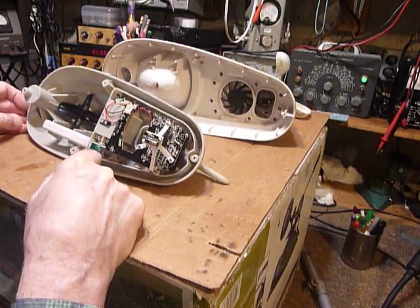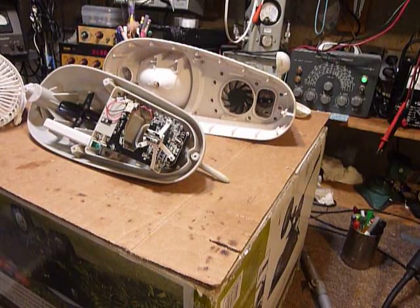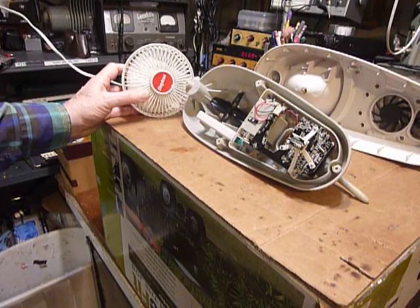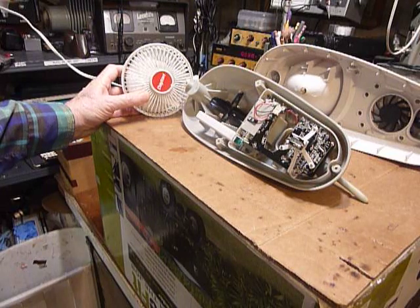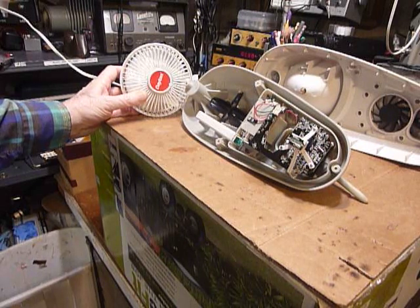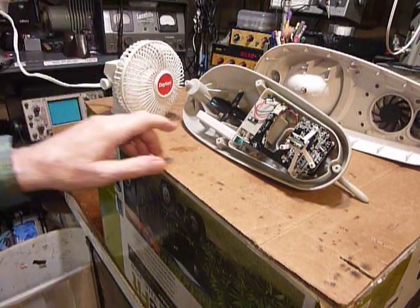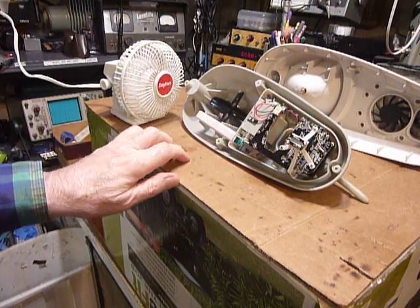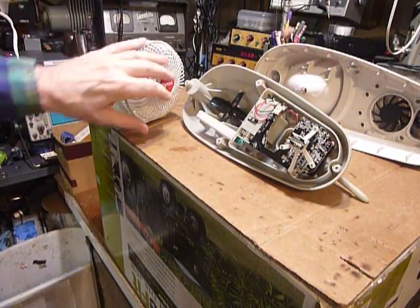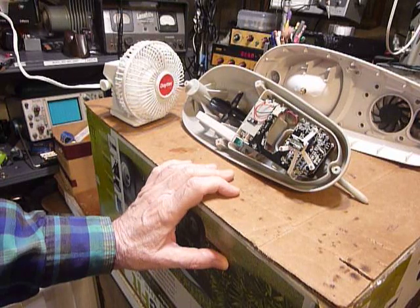So what to do? Well, what I did was I took this little fan I have here, sitting over on the corner, blowing across the work surface. The reason I have that is because it blows the soldering fumes away from me, so I'm not breathing them in while I work. So I just moved this little fan over here and set it up to blow onto the circuit board and all. I also arranged the other half here, which had some water in it, sitting close by, and was blowing this air through it all. And I left it set here for 4 hours, and it is dry.